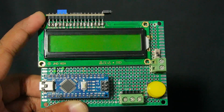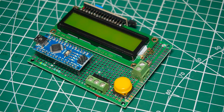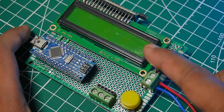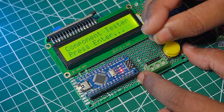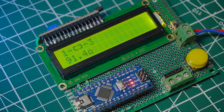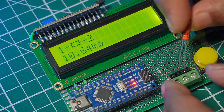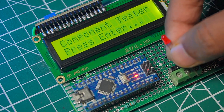To make the project compact, I mounted all the components on a double-sided PCB board, and used a 16x2 LCD display since it's smaller than the 20x4. Connect a 5 volt power supply to the power supply terminal, then switch on the project. Place a 100 ohm resistor into the test pin and press the test button. Then place a 10 kilohm resistor into the test pin, followed by a 10 microfarad capacitor.